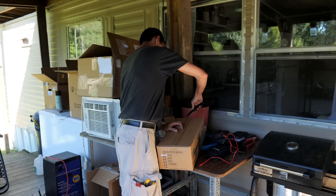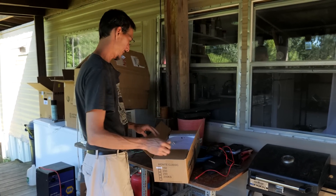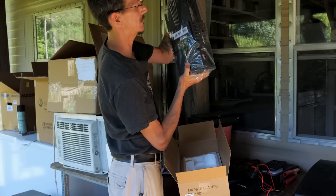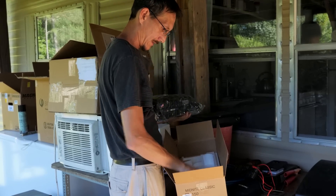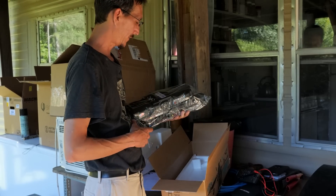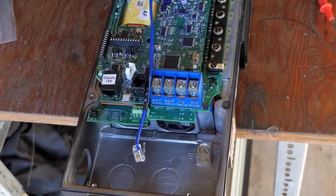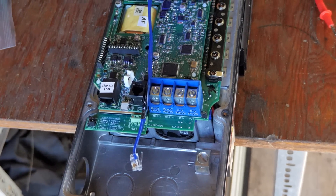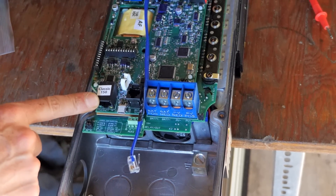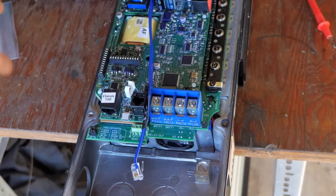I'll put the SPD on, and now I'll install the new charge controller to replace the bad one. This thing's pretty heavy — about 12 pounds. It has a battery temperature sensor, which we're not going to use because we already have it installed. This lead plugs into the front cover to get to the display. Here's the ethernet port if you want to monitor it on your computer, and here's the battery temperature sensor connection — which we won't use since our master controller already has that. We're going to link these together in Follow Me mode. These are the terminals: battery plus, battery minus, PV minus, PV plus.